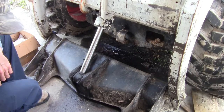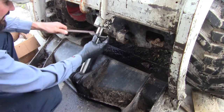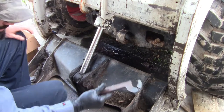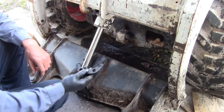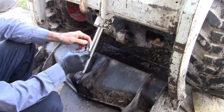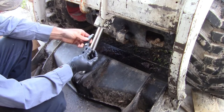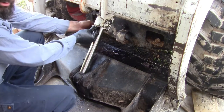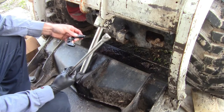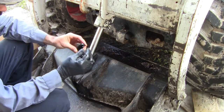For these rings there are two types of spanner wrenches. The first type my John Deere uses has a notch or groove on the outside and you put that in the notch to turn it off. The second type, which I picked up, has two pin sizes, one on each side, and you put those into little holes in the cylinder. Then you can put a breaker bar on it and take that off.